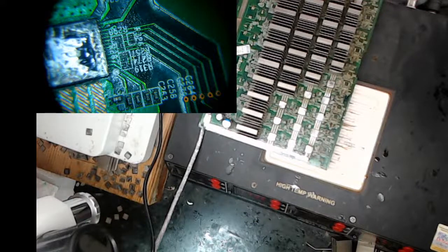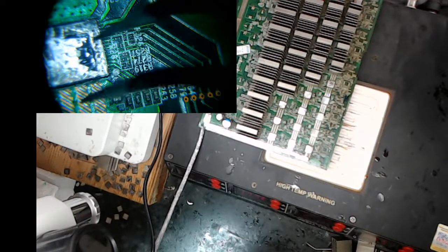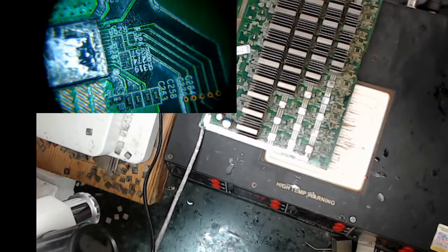If you test the diode, I've had two boards that I've fixed, and every voltage was good. I went through and made sure every resistor was right. It took a long time. There's 65 chips on this thing. And then sometimes it would say no, all ASICs found, and then sometimes it would say zero ASICs found. I just never could get it down.